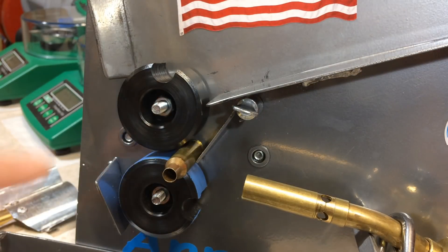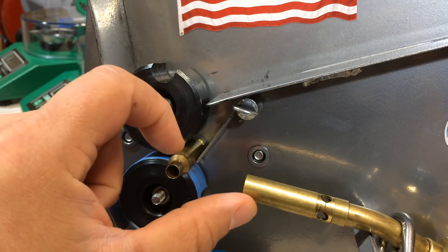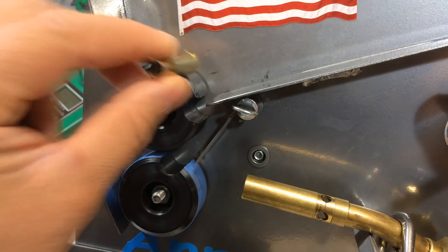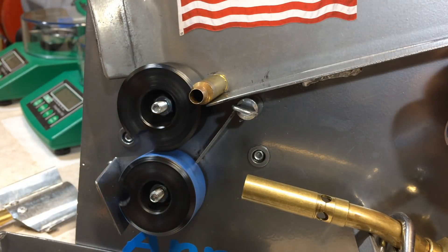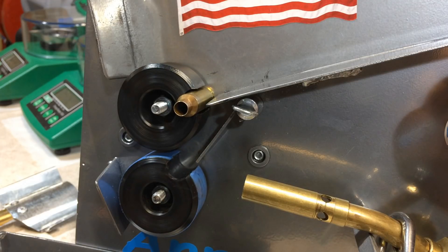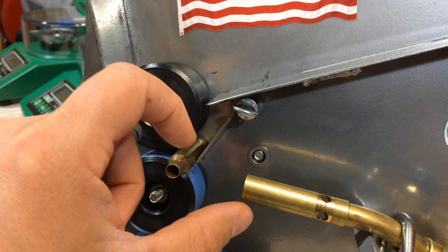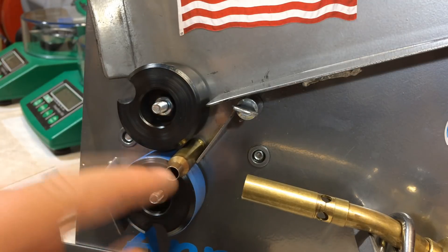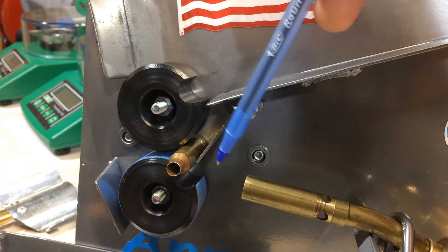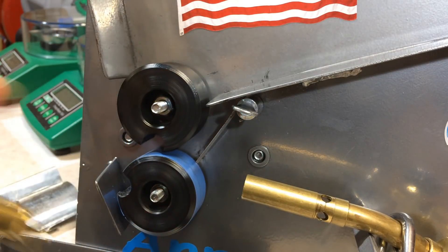A quick lowdown using test brass: it doesn't matter if this gets red hot, it's already destroyed anyway — you're just using it to set the flame. Put your speed control on a low setting. Speed it up so it catches the wheel, then slow it down. Get it into the flame. Get that flame approximately one inch long, make sure it's centered, the tip of the flame is about an eighth to a quarter inch off the brass, at the junction of the neck and shoulder. Once you get this set up and it's just right, run to part three.